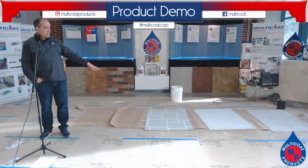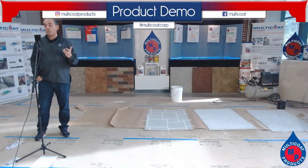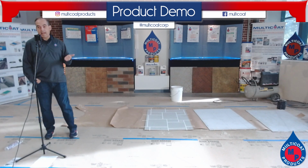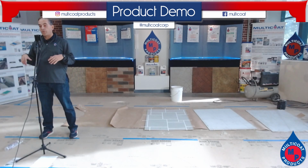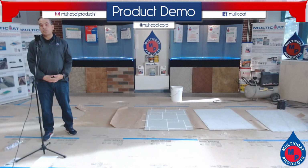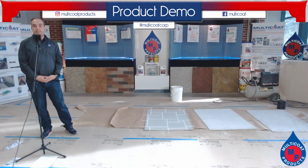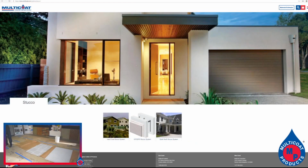While he's showing you these, I wanted to let you know that you can do these vertically on walls. Today we're not going to show you our stucco products, but I just want to kind of touch on them. We make both an elastomeric and an acrylic stucco, and we have stucco systems for both foam, EIFS, and hard coat. We also have a one coat system that we've patented with an elastomeric joint tape. As you can see on this house in the picture, some of our stucco. If you look up on the walls behind me, that's some of our stucco there with our stencil system.